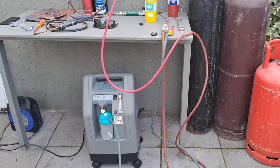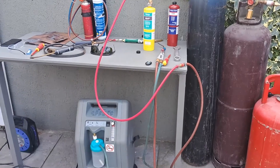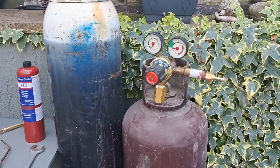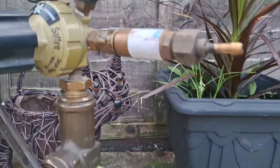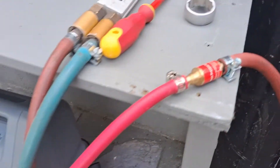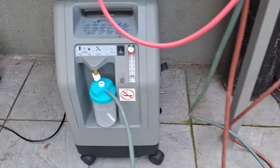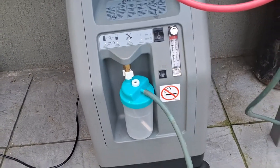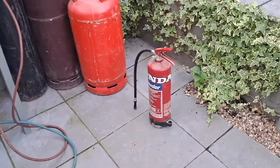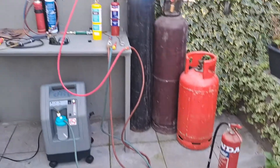You can see how easy it is with a few little adapters, connectors, bits of pipe and clips to experiment with different types of gases and alternative methods. I do always think it's quite important to have some kind of flashback arrester on the gas bottles. We don't need a flashback arrester going into the oxygen machine — there's nothing dangerous there — but I've always got a fire extinguisher to hand when I'm experimenting or welding. You just got to be careful.